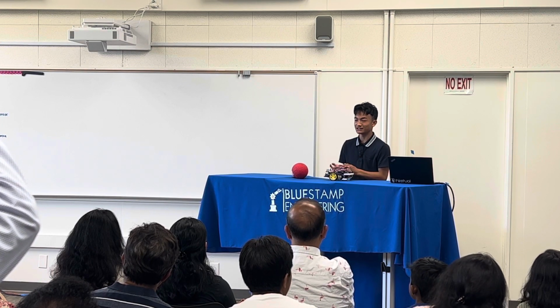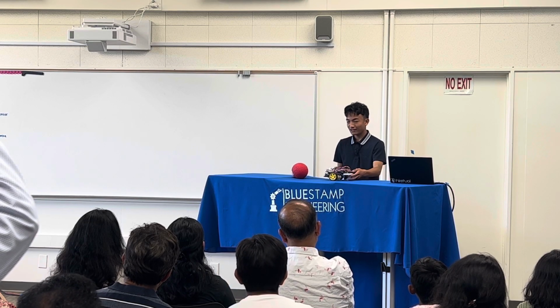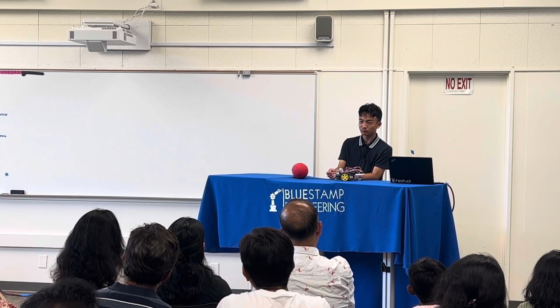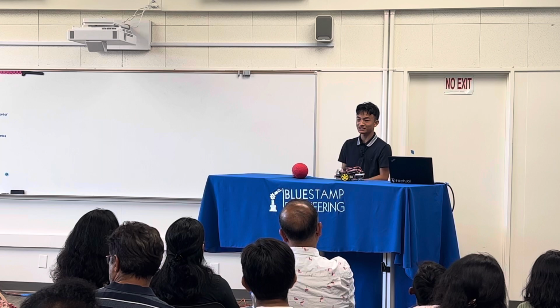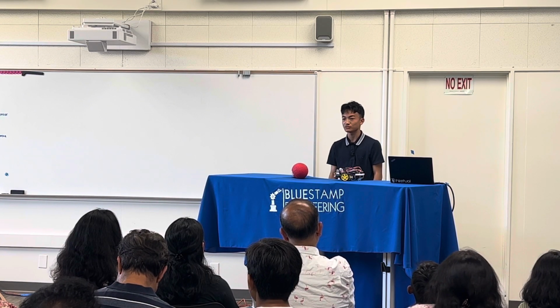And what they do is they tell the distance between an object and the robot. They do this by emitting an ultrasonic wave that bounces from the object and back, and it uses the time that it takes for the wave to bounce there and back, and multiplies it by the speed of sound, and it divides it by 2. This is how you get the distance in centimeters.